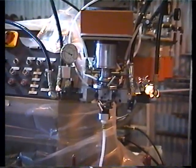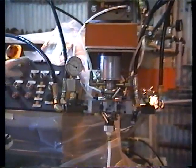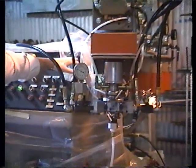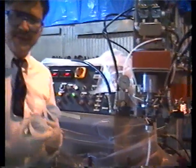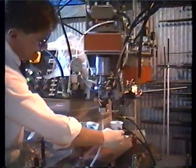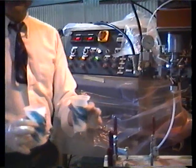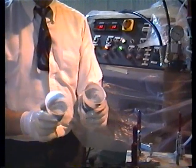In addition, we have high-pressure safety on the machine. For calibration, we set our calibration timer to three seconds to get an idea of output versus displacement — the cc's per revolution the pump is displacing. We simply put the cups underneath the calibration port, run for three seconds, then take the cups, weigh them, and make any proper adjustments to ensure the correct ratio.